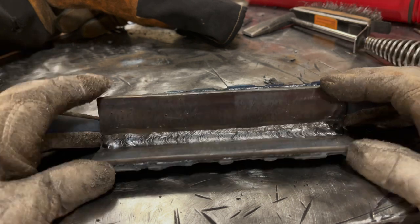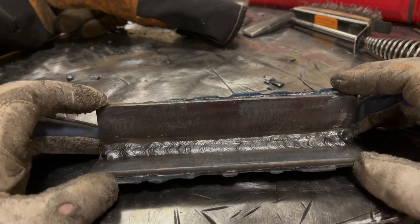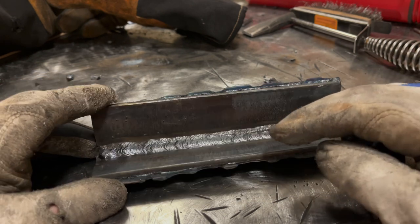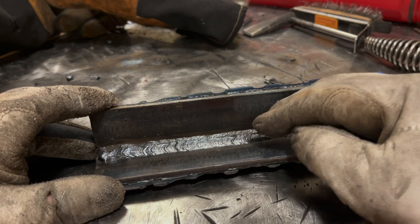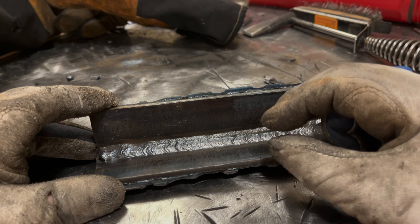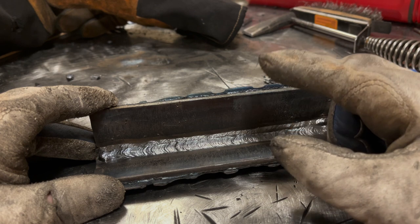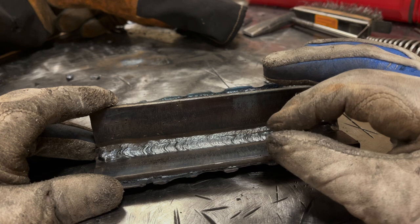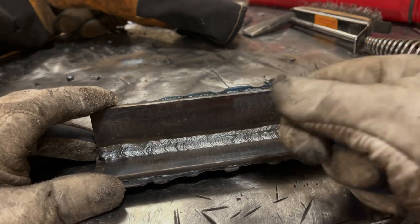The other thing, and I kind of mentioned it in the video, is that with this 6013 rod you really have to push on it. It seemed very easy for me to just let it do its own thing, all while the flux was extending and the rod was burning off higher and higher inside the flux. Next thing I know, it blew out the side. What I thought was arc blow, which it was indeed, was I believe caused simply because I wasn't putting pressure on that rod.